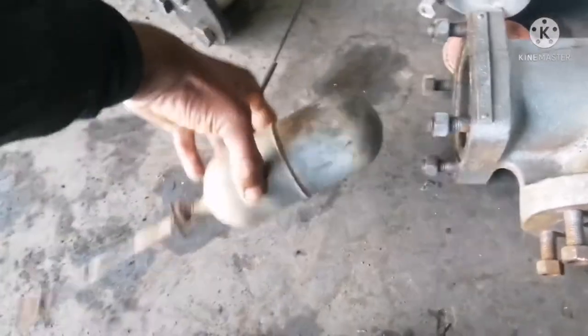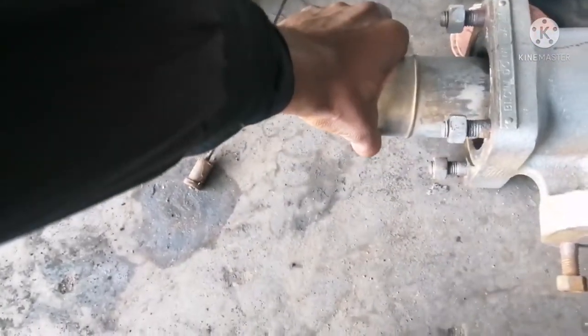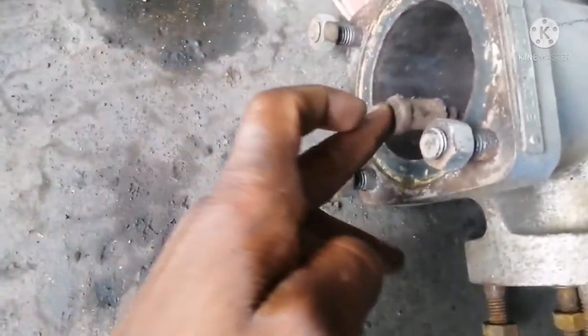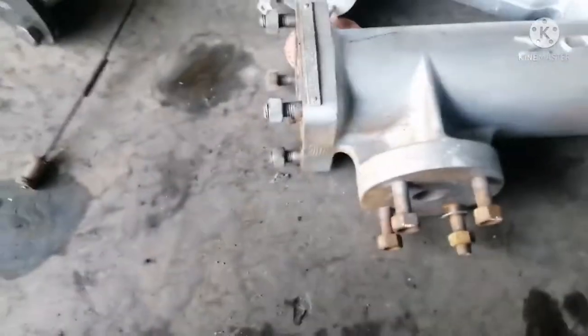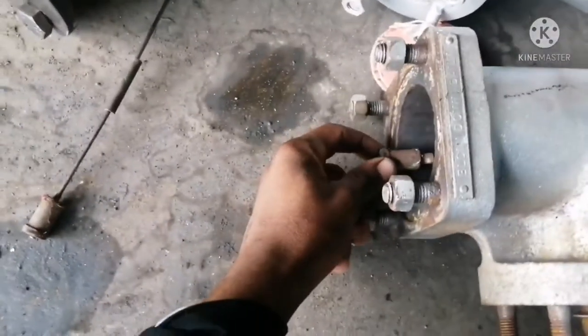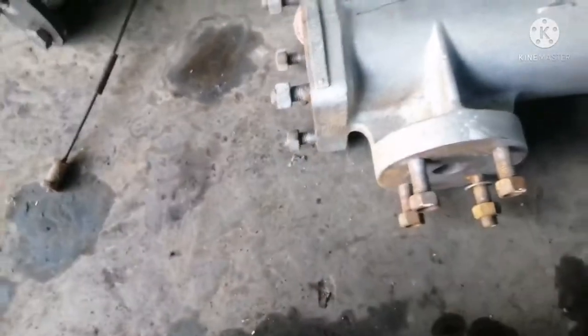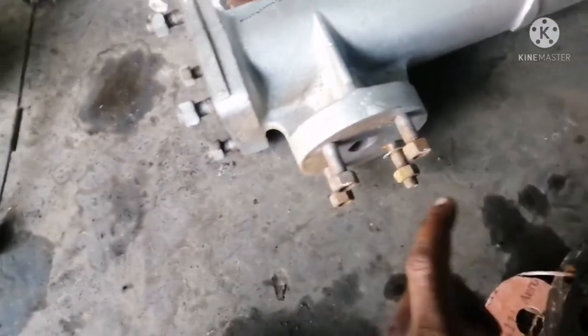This is a simple float. If it's upward, then there is water in our boiler. Then if it gets all the way inside, there is no water in our boiler. So since this magnet will be away from the sensor, then our alarms go on and start to ring.